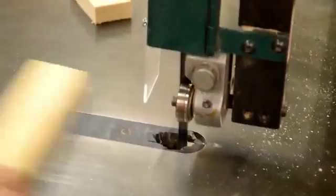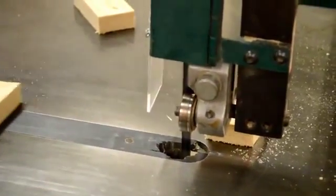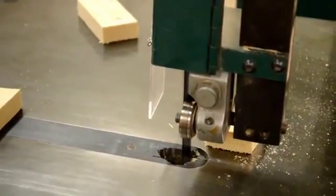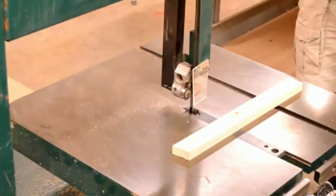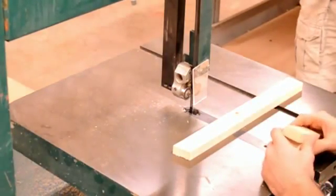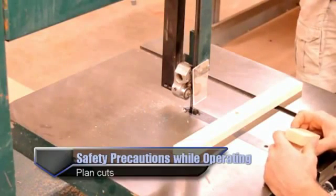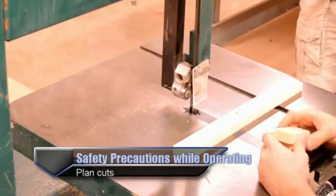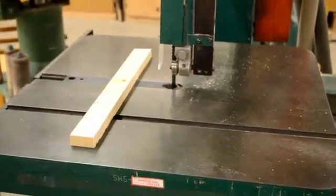Watch how long this takes — imagine that was your finger and somebody bumped you. Since your machine cuts so easily, a couple of things we need to do before we start cutting: one is to plan our cuts ahead of time. We can't just hope it's going to cut in the right place — we need to have marks on there and plan those cuts accordingly.